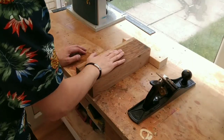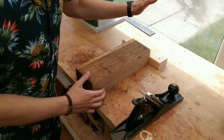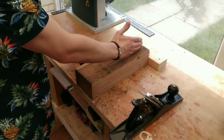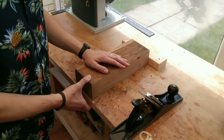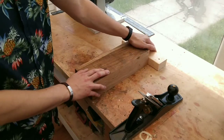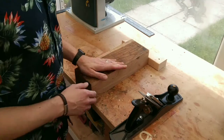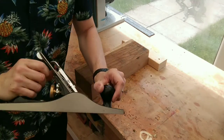Now I'm going to demonstrate how to use your hand plane or bench plane on your workpiece. First of all you've got to secure your workpiece to the bench. What I've done is just screwed a scrap piece of 2x4 on here to put it against, so the forward pressure of the plane won't push it along any further. I prefer not to use a clamp because the clamp just gets in the way — you'll have to keep repositioning it. If it's a smaller piece, I'll screw a scrap piece in front and another one behind to stop it moving backwards and forwards.